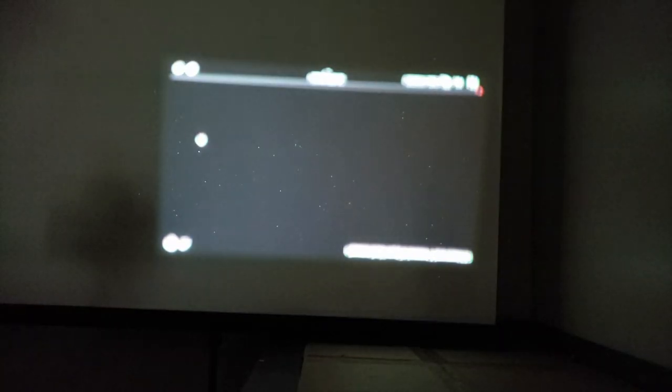Well, those lines are the damage monitor. Don't worry about those, but it should be a black image. And instead, we have either dust or what I'm starting to suspect are bad pixels. I hope not. But it sure looks like it. See when I put the pointer? You can still see it. It changes as I go past, trying to get it to possibly flip. But this looks like a bad DLP chip.